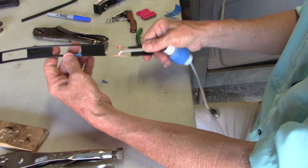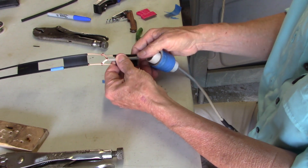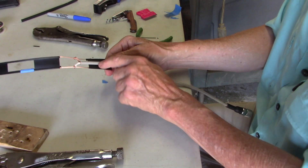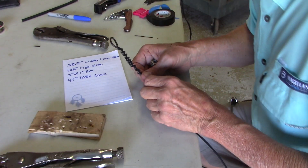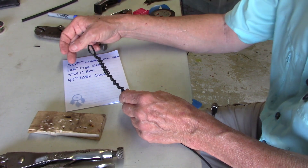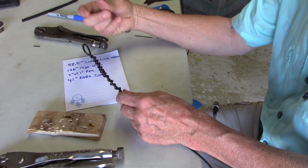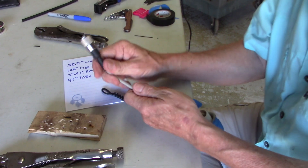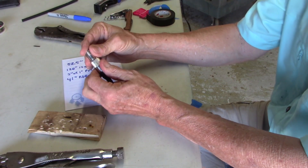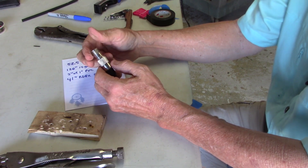I have the center connector side on one side and the ground shield on the other, with painter's tape marking the element side so I don't get mixed up. I'm going to take some tape and wrap around here for some strain relief while I'm testing. When I get it where I want it, then I'll put some holes in it and maybe some wire ties. For temporarily, instead of an insulator, I'm just making a loop in it. Remember, our element length is 126 inches for the starting point — I've got a good seven inches or so of extra. On the other end I've got the PL259 connector, and I like to use a barrel connector and then connect it to the coax. I've got 50 feet of RG8X laid out in the yard — let's pull this thing up and see what it looks like.